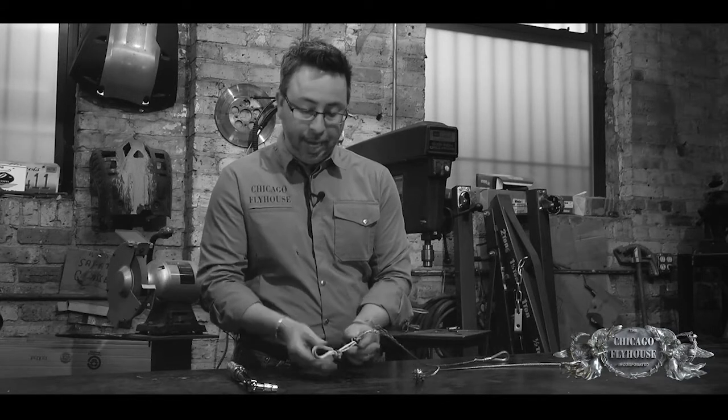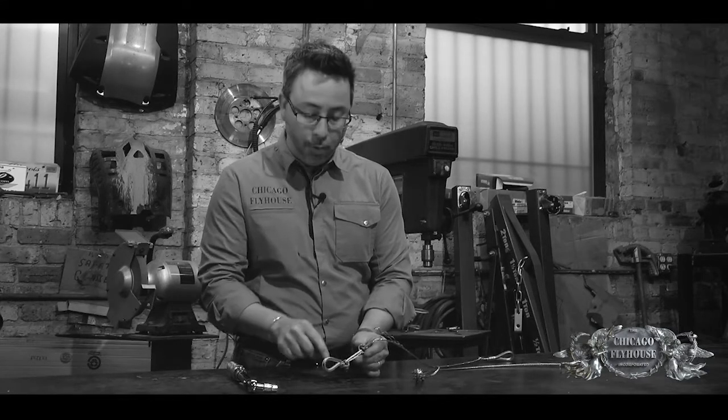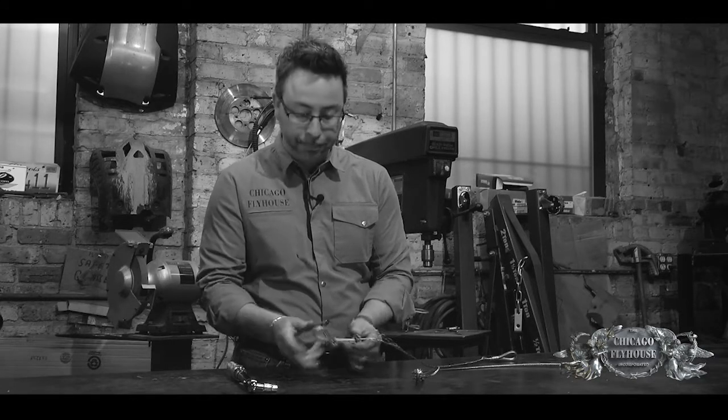The saddle is going to go on the live end of the cable — we don't want the U-bolt on the live end; we want the U-bolt on the dead end. After we've got it roughly placed, we're going to take our torque wrench, which is set to four and a half foot-pounds for this size cable clip, and tighten it down to torque.